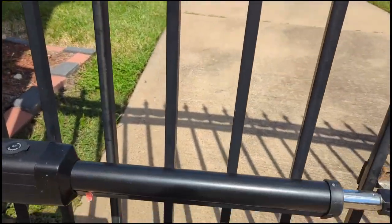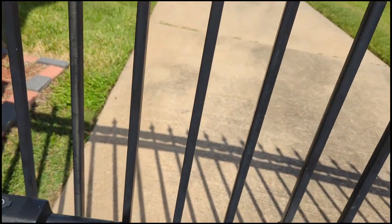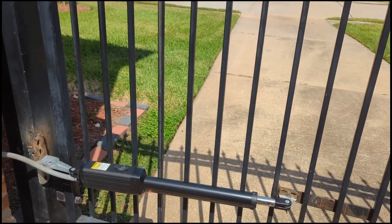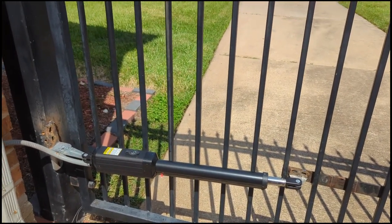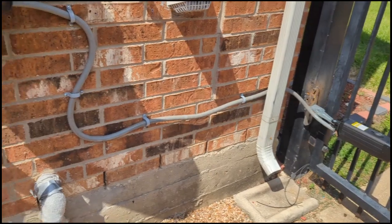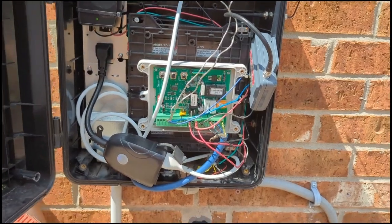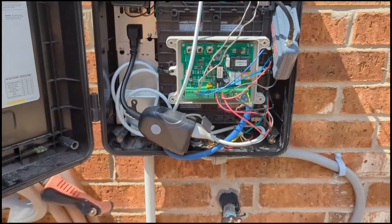As I mentioned previously, you do have the limit switches on each side and you have to adjust those. Just make sure that your brackets are in good shape. The existing brackets for my LA400 were on the outside, so I actually redid it and welded some new ones on the inside. Hope you guys enjoyed this video — like, comment, and subscribe. If there are any questions I can answer, please leave them in the comments. This actually fits perfect in this LiftMaster box and works out perfectly. In my next video, we'll talk about the add-on Homelink adapter. Thank you for watching.